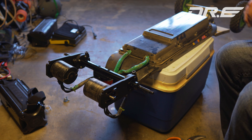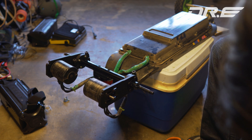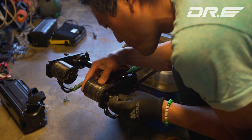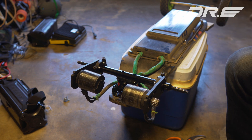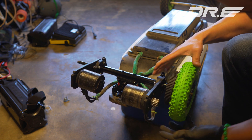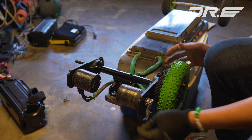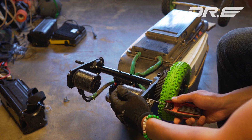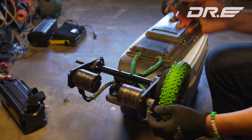Since my wheel pulley is huge, you're gonna have that space even if you use super large wheels — 9 inch wheels. I'm gonna go ahead and put the pulley back on, insert the pulley, and just align it. I'm not gonna screw it in right now because I'll need to put some Loctite anyway. I'll do a fit test and just align the wheels with the pulley. Make sure you push the motor all the way in, then tighten it a little bit just for fit testing.